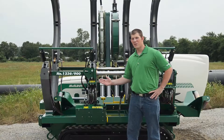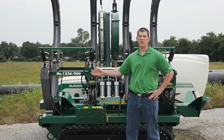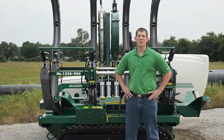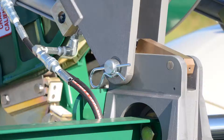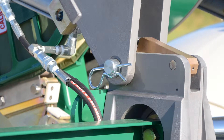There are two fixed jaws and two movable jaws. The outer fixed jaw is removable, so you can set up the carriage in a three- or four-jaw configuration, depending on your application. The jaws are hydraulically operated. Notice also that the carriage is top-loading and has pinned upper jaws that can be removed quickly and easily for in-ditch applications.